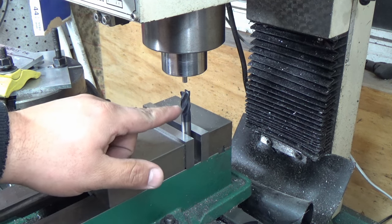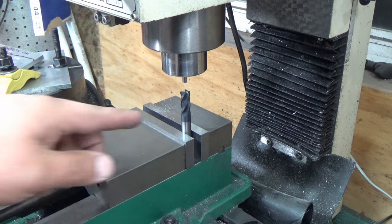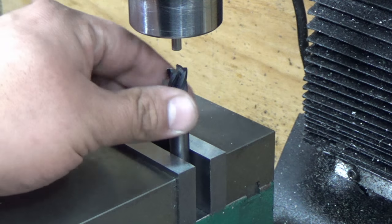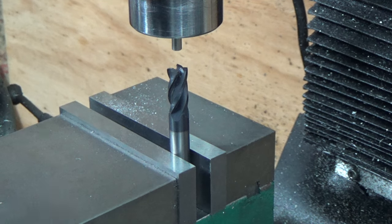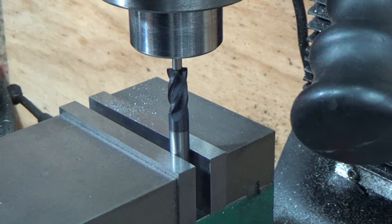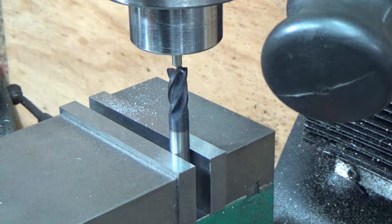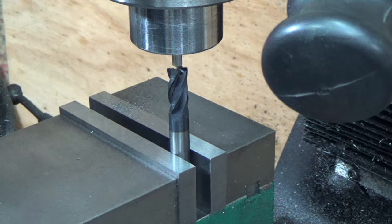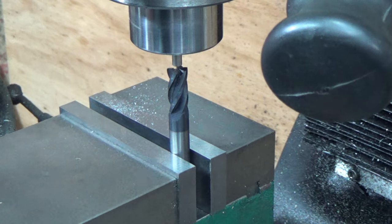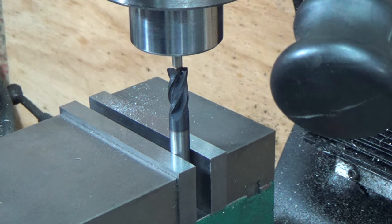It's a 10-millimeter end mill — the size doesn't really matter as long as it's bigger than the pivot itself, so even a quarter inch should work. It's centered over the end mill, which is just standing freely in the vise. It doesn't have to be perfectly aligned, but it should self-align since it's standing and it's flat on the bottom. I'll take this down here and set my digital readout to zero as I'm holding it — so now I know where our starting point is. I'm running at about 800 RPMs and just nice and easy, sneaking up to that 68 thou.